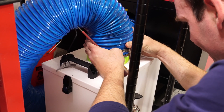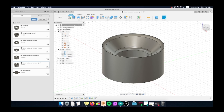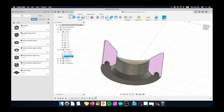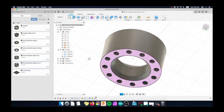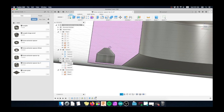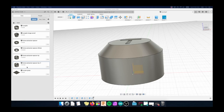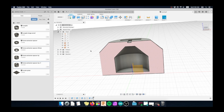I went back to the drawing board and made something with magnets. I was actually pretty proud of this even though it didn't quite work as well as I'd hoped. It's got these little slots here so you can embed the magnets when you're printing. One mistake I made is that when you're trying to embed something during a print, you need to make sure everything is locked in place. There's an M84 command on your printer that you need to put in, because if you don't, the bed can just fall.